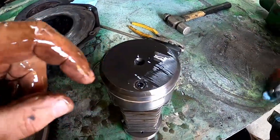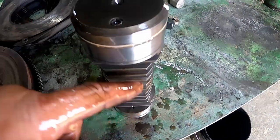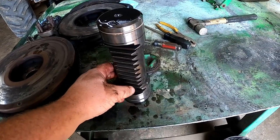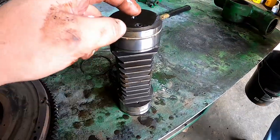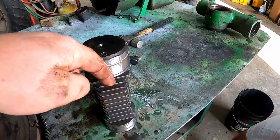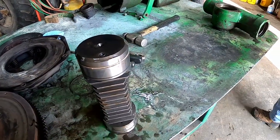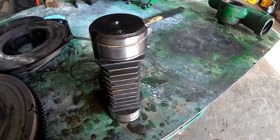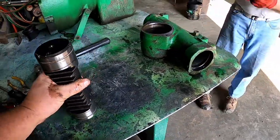These little pins — there's a little check ball in there on each end. If the piston seals get bad and are letting oil by out into this chamber, that could make it get over-pressurized and blow the seals. So it has a spring and a check ball: if the pressure gets high enough when steering one way, it can unseat the ball on the return side and return with the other return oil as the rack moves. That's just there to keep the steering box from getting over-pressurized and making the seals fail.